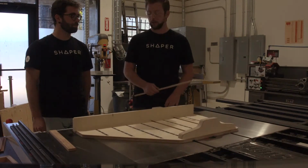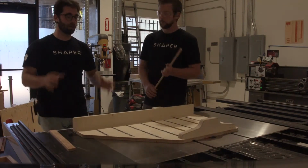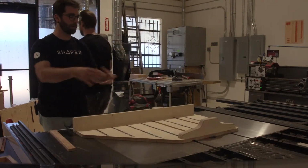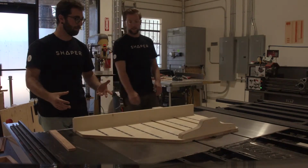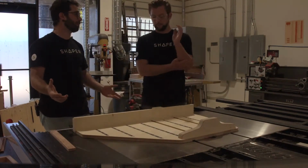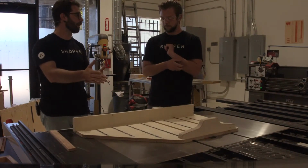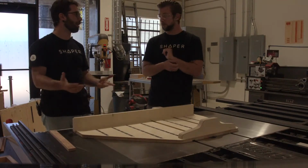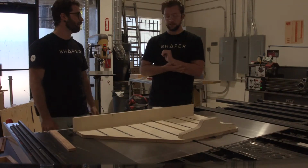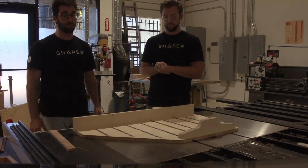And it's all coming off of Origin's original cuts. Yep, that first rail that we're cutting with Origin is what's constraining the perpendicularity of this crosscut sled. And it doesn't have to be perfectly perpendicular if you don't want it to be. If you're cutting a 10-degree angle on something, you could make a 10-degree crosscut sled or a 45-degree miter sled. Yeah. This file is for a crosscut sled, but it's all flexible.